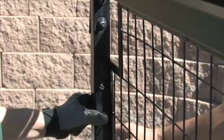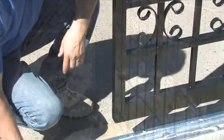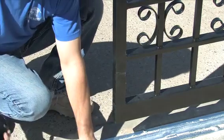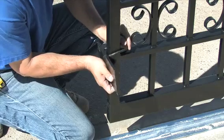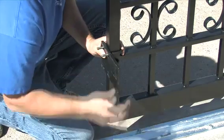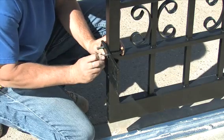Now fasten the safety screen to the gate panel. This is a crucial step and should not be skipped for any reason. Leave gate in open position. Attach a chain bracket with U-bolts to each end of the gate, 12 inches from the bottom of the gate.